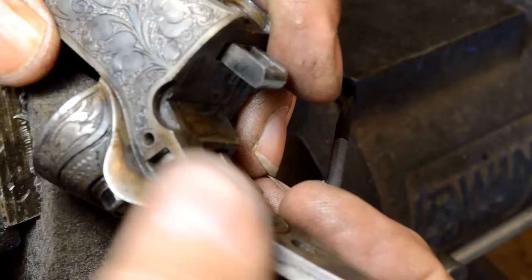We have detected an anomaly. While I'm pretty certain that this barrel has actually got a 9.3 by 72 rimmed chamber in it, that casing just doesn't go down there — and if I beat on that with a hammer it'll barely go down flat. Ask me how I know. Anyway, we lift this back up — this has been sized already in a sizing die.